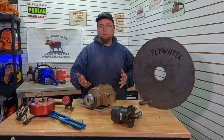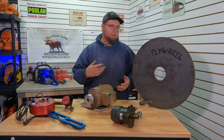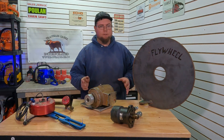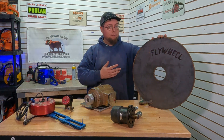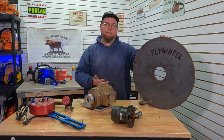Since we're talking dynos, let's go over some of the common questions: how to do a dyno, what kind, where, why, how much? We have here a flywheel for your inertia-type setup. On inertia setups it's about as simple as you can get — you have a flywheel of known mass and known diameter on a shaft, hook your engine to it, and all you need is something to measure time and something to measure RPM. Since you already know how much it weighs and what size it is, you can calculate how much time it takes to reach a certain RPM.